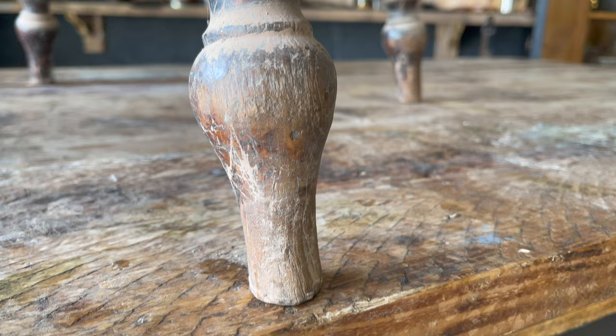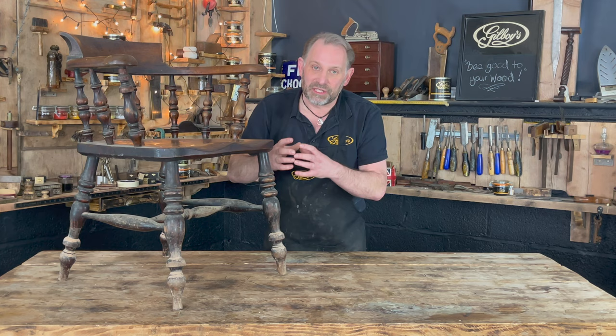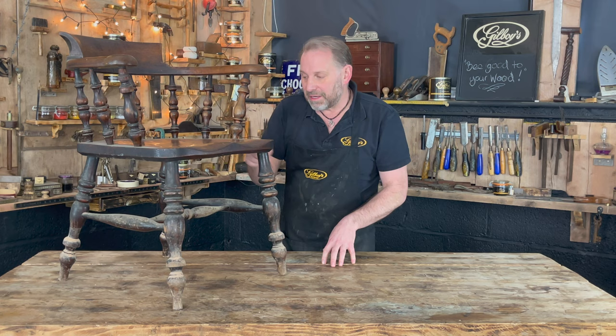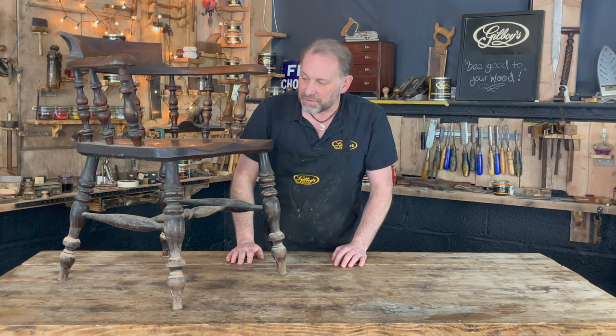Now this is a shellac coating that the Victorians used to use, maybe the Edwardians as well, I don't know. It's shellac dissolved, so it was a liquid shellac, and in that shellac they would have a color, a stain, a dye. Rather than just wax polishing something to revive it, they would give it a coat of this shellac. It was just brushed on quickly, and it revives the finish really nicely, very fast, but it also darkens it down. Repeated applications end up almost looking like ebony.